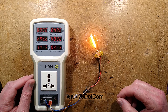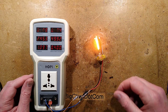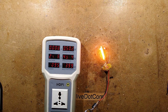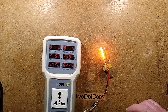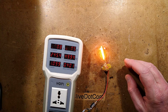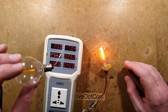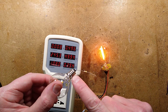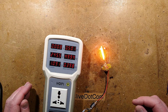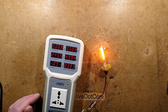That's it. It's a nice lamp, very simple circuitry, and it does the job nicely. It's also quite pleasing hacking it up with a bit of DIY circuitry to see if it could be done with resistors. Some lamps like this one actually do use resistors in the base - I've added more resistors on the outside to test this. But those lamps crudely use LEDs for bridge rectification, which is a bit naughty, and they tend to fail a lot. That's probably why. But this is a nice lamp.